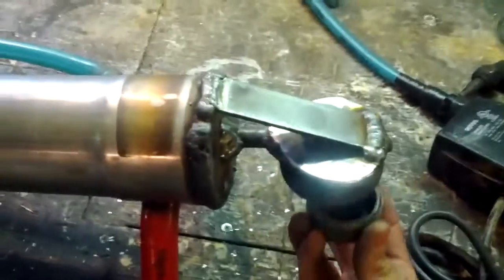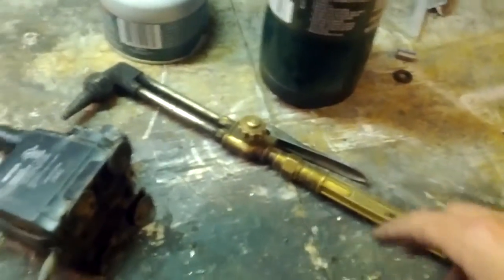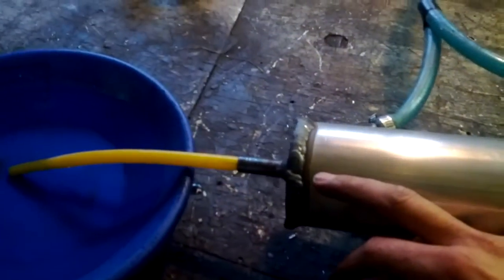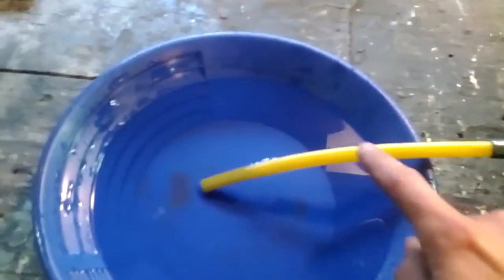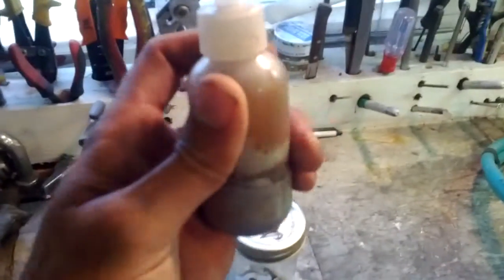You put your amalgam in here, put this up in there like so, hang it down real good, then you hit this with the torch. You can use a propane torch — even something like this under there — probably use a little more heat to make sure I get all the mercury out. While that's being torched, the water circulating through this pipe keeps the inner pipe cool, and as the mercury vapor travels down the pipe, the center pipe gets cooled so it returns back into liquid form, where it comes out into your pan so you can recover it and store it safely. A little bit of mercury — it's pretty dirty, it's been cleaned, but it's heavy stuff.